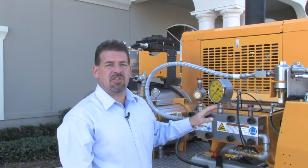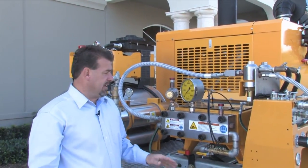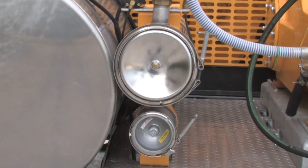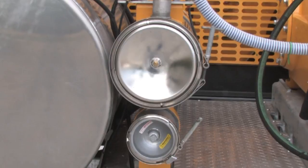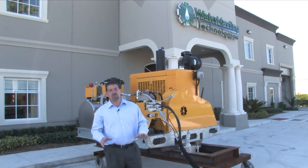The HT5000 incorporates up to three bimode valves, making it possible to run three tools from the same pump. In its current configuration it utilizes a Jetstream 6 GPM pump, though it can be upgraded to 7.3. It also incorporates a 10 micron bag filter and a 1 micron absolute cartridge filter before the water reaches the high pressure pump. If you're a contractor, I urge you to consider the usefulness, the practicality, and the financial benefits of owning the HT5000. You eliminate the air compressor that's sucking six gallons of diesel fuel an hour, and you eliminate the need to keep your bimode valves 25 feet from your operators — keeping them instead in a clean, safe environment. Give us a call, come down and see us, see this machine at work in our fleet, and I'm sure you'll be convinced it's the right tool for you.